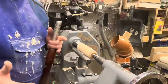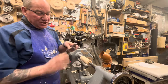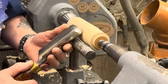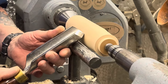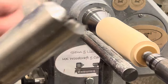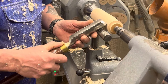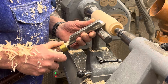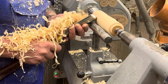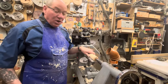It's only the distance of a hair that makes the difference between bevel-controlled or not. If you haven't got a bevel you're just scraping — no depth control. With a chisel sharpened with a nice curve, around a 30-degree bevel, I get my bevel on — no cutting — rotate my tool, now I'm cutting but my bevel is in full contact and I get these lovely fluffy shavings.